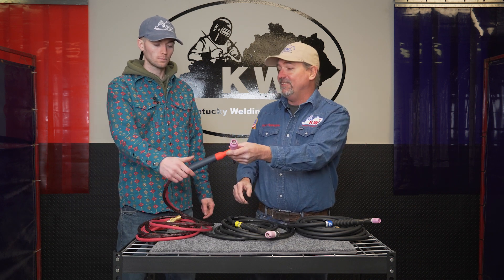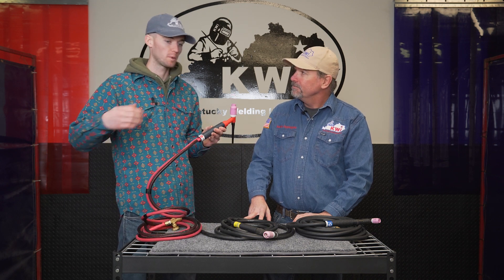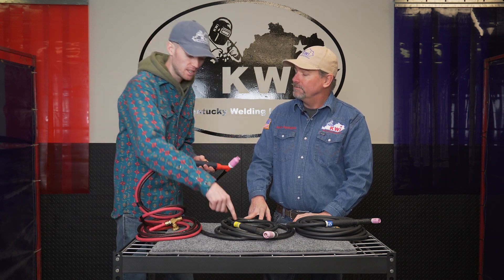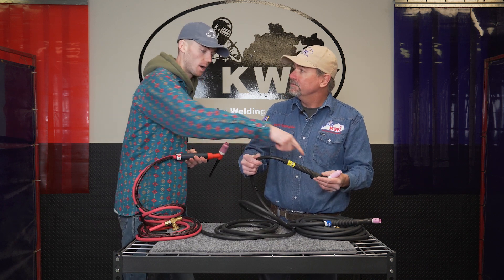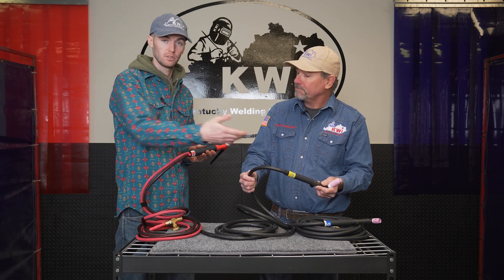Where are you going to run the Heavy Hitters 250? The Heavy Hitters 250 TIG torch is for welding heavy wall pipe all day long. The last job we were on was in Wyoming — it was heavy wall stainless, chrome, carbon, and Inconel pipe. The reason you want a two-piece TIG torch if you're welding big pipe for 12 hours a day is that the argon coming into your TIG torch is cooling it down. With a one-piece it comes through the line with copper around it and it's hot when it gets to the torch. With these two-piece rigs, the argon is cool and it cools off the head a lot faster than the other TIG rigs.